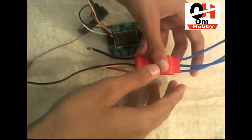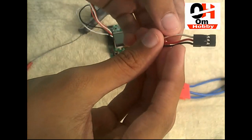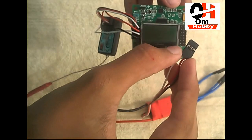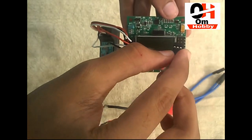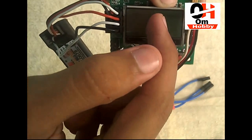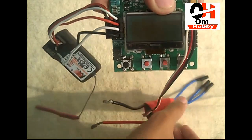This is the ESC, which is called electronic speed controller — it's used for controlling the speed of the brushless motor. Again, those are the signal pins: the white wire means signal, and the other wire is used for supplying power to your flight controller. This is the ESC and those are the output pins of the flight controller. Put the ESC on the first channel output, and notice — the signal wire goes on the inverse side of the flight controller. Don't put it in the wrong way.